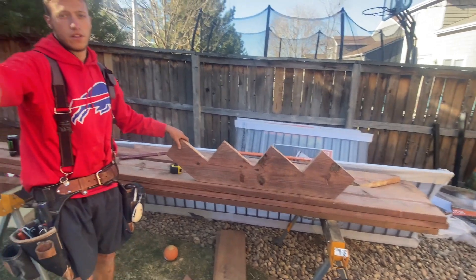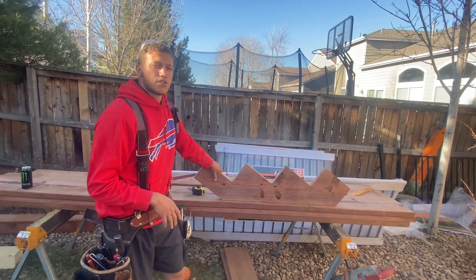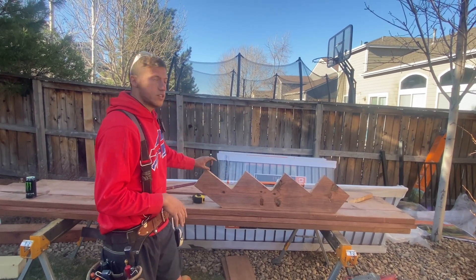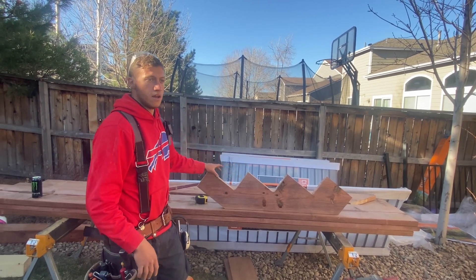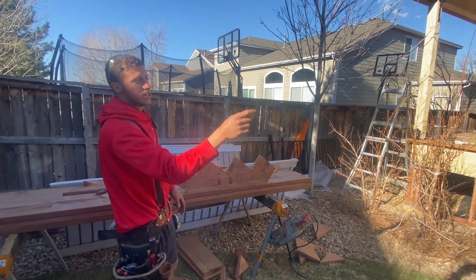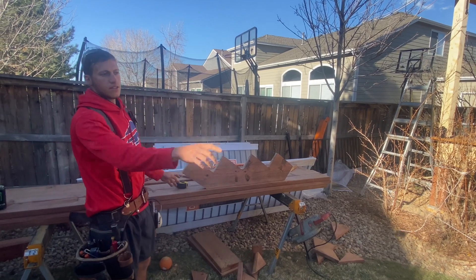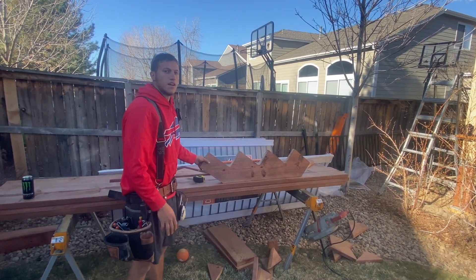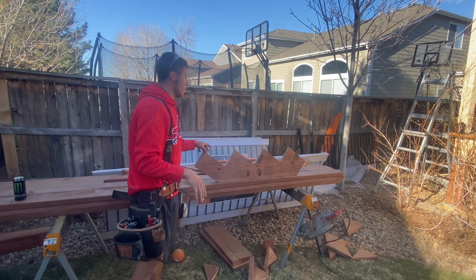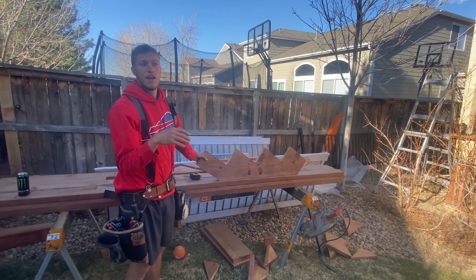That's the template I cut out. I brought it over and tested it to make sure it's level. Something specific to decking: all your stair rises have to be consistent. If I cut this first step the same as the rest and then put a deck board on it, that first step would actually be an inch bigger than the rest, because I'm measuring off the decking and there's already a deck board up there. So when I hang this, I'll actually have an eight inch step, but once I put decking on top it becomes my seven inches. So for that first rise, since I'm sitting on concrete and not on another deck, I have to cut an inch off so that the rises are consistent — and that's all incorporated in the math. Once you cut your first one, take it over, set it at the height you want on your rim, and check to make sure everything is level and your rise and run are working.